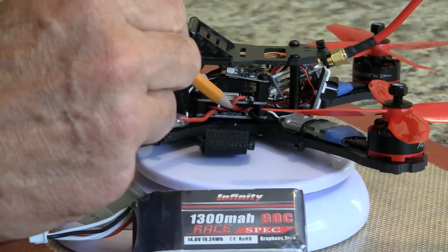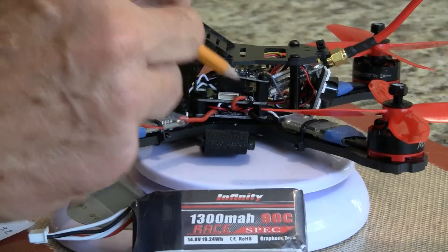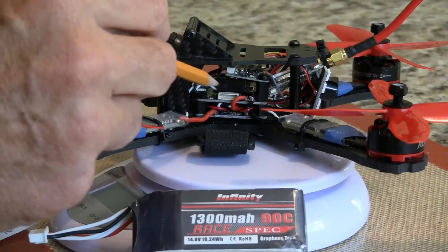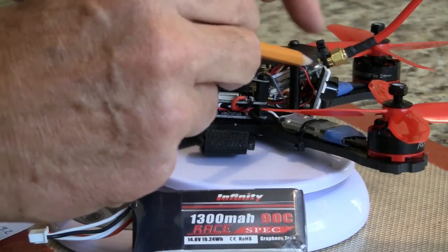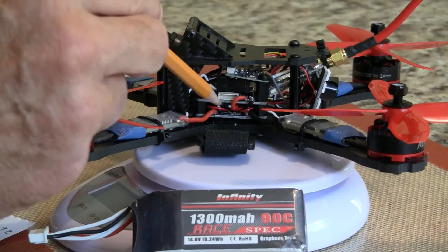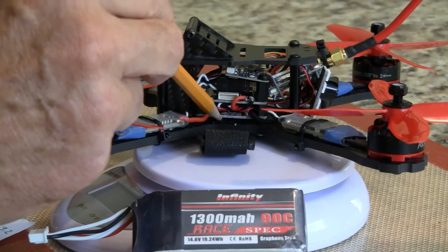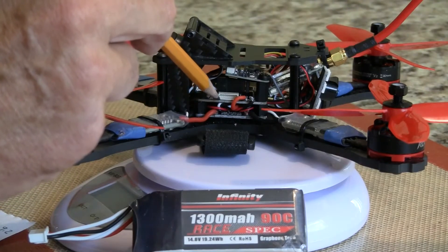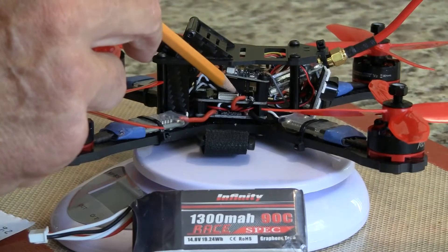Some items on the build: there's not a lot of room between the top and bottom plate — only 30 millimeters. I was having problems getting the camera to rotate; it was stuck in the up position. I had to rotate the flight control board 180 degrees so the camera would move, and that meant the VTX could not lay flat and had to go in at an angle. Everything did fit, but it took a lot of working around. If I had to do it again, I'd probably order a combination flight control board and power distribution board. I'll put one in the description below. Another option would have been to solder the ESCs directly onto the flight control board instead of using pins and JR connectors.